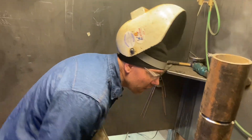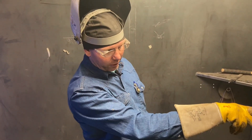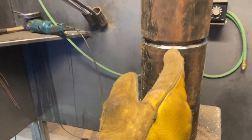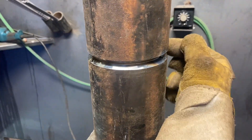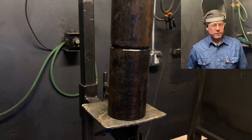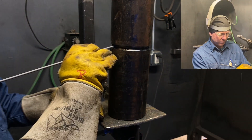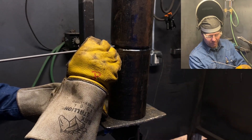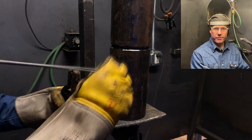Now we're ready to start welding. I'll probably quarter this out — I'll start on this tack, running left to right, get to about center line right there, and I'll stop. When I stop, I'm going to run around and feather any tack that I need to feather. I'm going to hit it with a grinder to make sure I make the tie-ins really good. When I come off of these tacks, I'm going to start half inch, three quarters back behind my keyhole there, and I'm going to start pushing before I get to that keyhole. I should see that keyhole light up ahead of me, and that way I know I made that tie-in really nice.